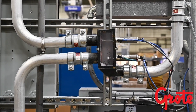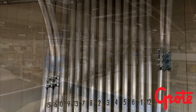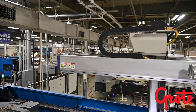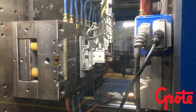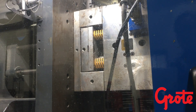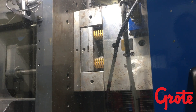The pellets are then fed through a material handling system and delivered to individual molding machines located throughout the facility through a complex system of overhead pipes. Once inside the barrel of the molding machine, the nylon is heated upwards of 500 degrees Fahrenheit. The molten nylon is then injected into the mold using a screw which pushes the hot, lava-like nylon into the mold.